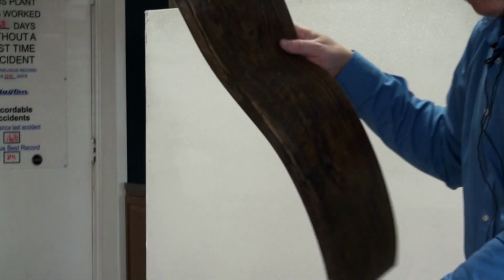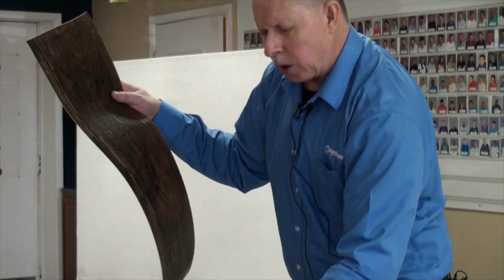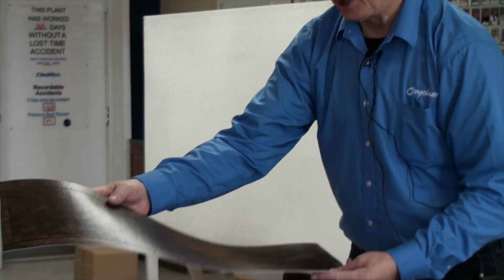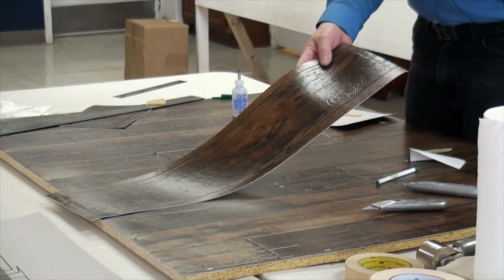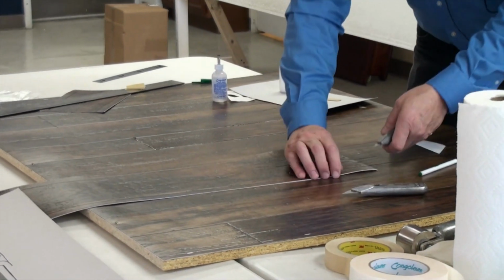I did it before with just any board or any sample, but here it's required that I try to find the identical board. It's also better to get that identical board off the same side of the roll, so shade, texture, and gauge are very close. So you'll size this up. You will simply line it up.